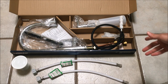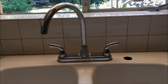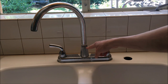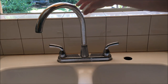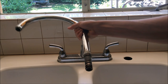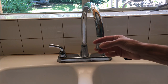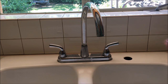We're going to be installing this today to replace the existing kitchen sink. Here's the existing sink — this one is fairly old, probably at least 10 years old, and as you can see, some severe corrosion has set in on the swivel point. The biggest problem is it's actually disadhered itself from the actual mount underneath, and as a result we've actually had to remove the aerator from the end because otherwise it builds up too much pressure and it pops off.